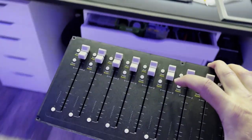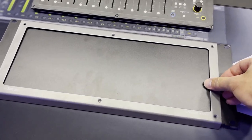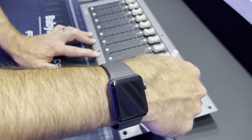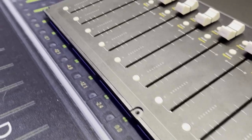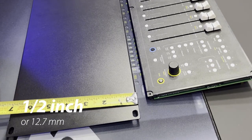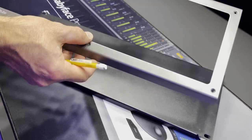So now I'm bringing it back to the desk and what I need to do is use the original face plate and trace it out on our 4U blank panel. I'm re-lining all the screw holes up and drawing a pencil line because I need to utilize every little centimeter of space. It turns out to be roughly a half inch — just a smidge over. So I'm going to measure from the very top of the blank panel, measure down a half inch, and that's where I'm going to line up the original face plate so I know I'll have that gap to barely fit this in here.